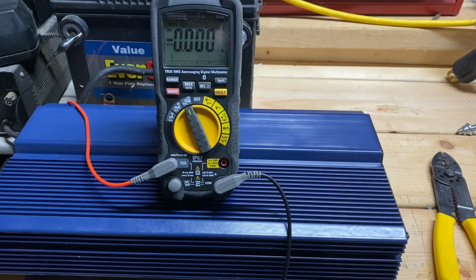One characteristic often overlooked with inverters is how much current does it pull when it doesn't have any load on it. I'll call it idle current, but this one's got 3 fans that turn all the time, and so regardless of load, it's going to pull at least 2.5 amps at 12 volts. So this may not be an ideal inverter for an off-grid solar powered setup.